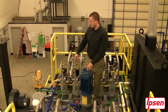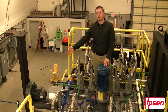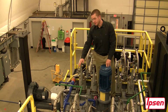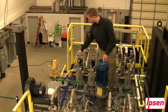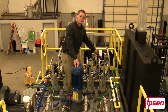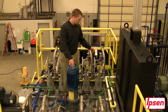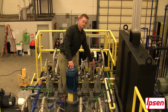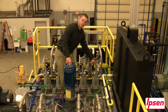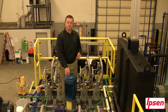On the other side you will see a regenerative blower which provides clean air to our combustion air manifold. This manifold is identified by blue and you can see how it's connected to the burner by a flexible stainless steel hose. Both hoses after going into the burner, the gas comes out through an exhaust located at the rear of the burner. This exhaust is then piped by customers at their own facility.